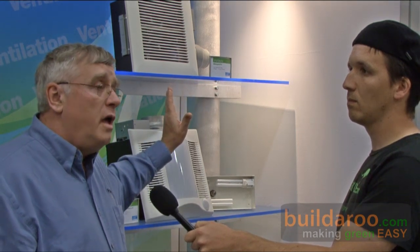You can set the fan for a speed you want — say 30, 40, 50, 60, or 70 CFM — and it'll stay at that CFM. Then it will kick to full speed of 80 CFM, or 130 for a different model. The idea is to have a continuous low level of ventilation, which is included in the ASHRAE standard 62.2 — the ventilation standard for residential construction. That standard calls for a continuous level based on the number of people and the size of the building, mandating how many CFM that is, but it doesn't tell you how you have to do it. So these are not just bathroom fans?